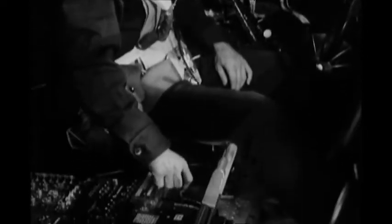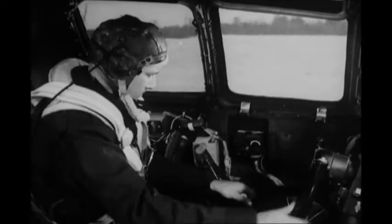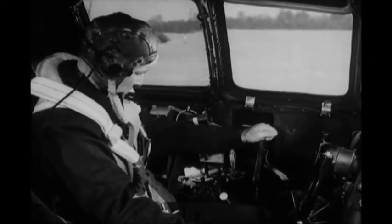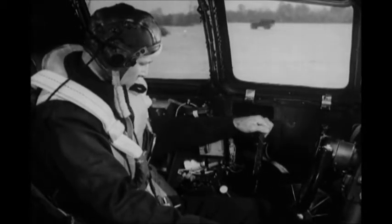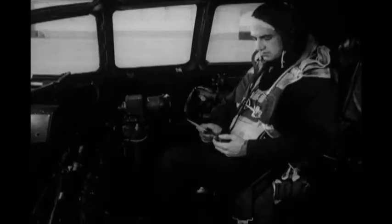Now unlock the control surfaces and throttles by moving the locking lever on the aisle stand full forward. Then release the throttle brake and test all 4 throttles through their entire range. Take it easy. Move them slowly and gently. All controls on the B-29 should be handled in this careful manner in order to prevent damage to the mechanism. There's no need to push hard.